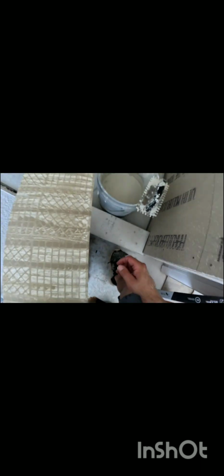And then I'll scrape it from the middle out like this. Then you'll take one of these sponges, squeeze it out, and wipe this around on all sides. You'll see why that's important when you're grouting. So go ahead and put this first one on here, right in the center. You already marked it. And really get some movement on it so that it sticks really well, especially these shower wall tiles. You want those to stick really well. And then do the same thing for all these other tiles.